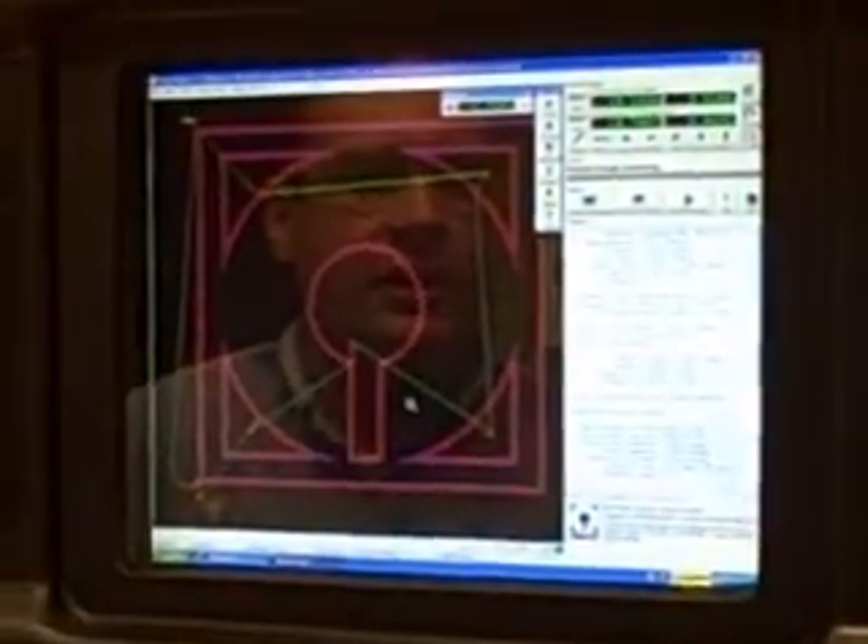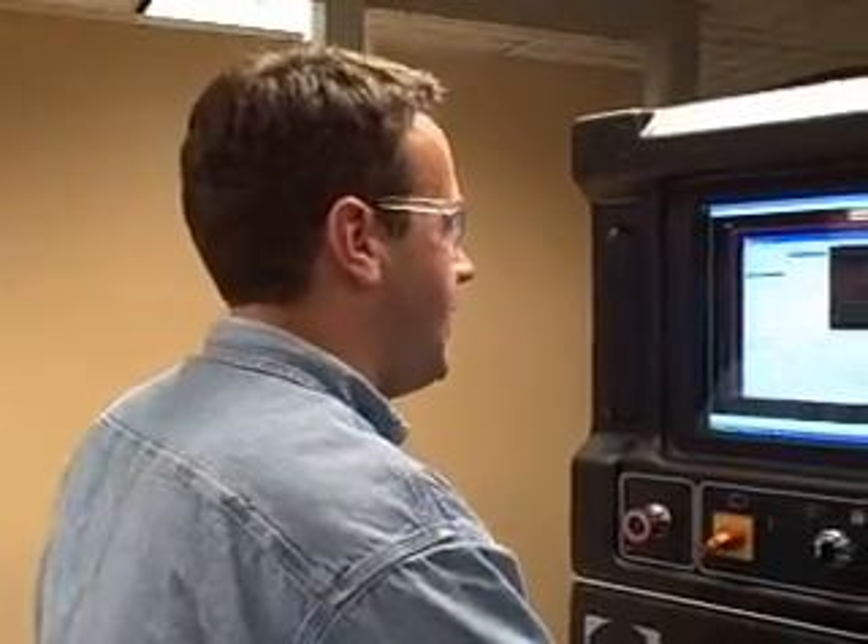We're going to go into our change path setup dialog and navigate to the folder where this is at, and go ahead and select the first file, which is our front end of the jet. I also need to make sure that everything is set for what I have on the table. I do have an aluminum piece, but it's not a quarter inch — we're actually going to be cutting through two inches of material, so I need to have that set. I'm happy with my tool offset, and I'm also going to enable tilt, courtesy of our Tilt-A-Jet accessory, which will remove taper from the part. So with everything in place, I'm ready to go.